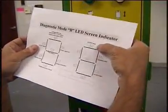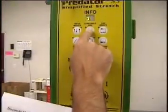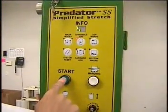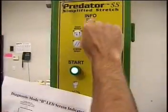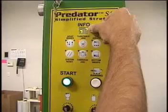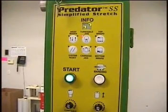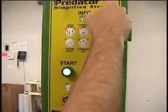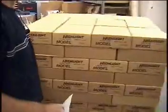To get the actual motors running and the start lamp to happen, select turntable jog and press start. As you can see, the start lamp is on the top one — A2. The turntable is rotating; the motor is on. The machine thinks it's on. If it's not, then you can start looking for fuses. Even though this says the motor is on but the turntable is not rotating, you can start looking at fuses.